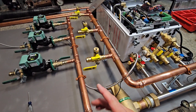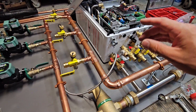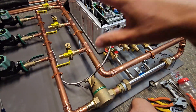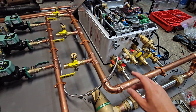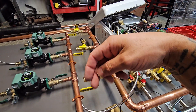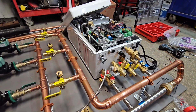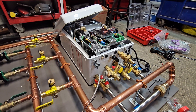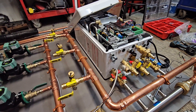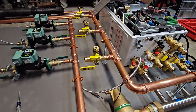That'll pretty much wrap up the wiring. Usually the customer will be required to run their thermostats themselves into the circuit board. What I've done sometimes is provide a terminal block mounted outside on this board, labeled for the thermostat inputs, so you never have to open this up. If you aren't comfortable doing that, I'll bring it right out to a terminal block and you can just terminate them right there.